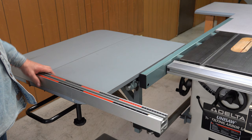And for number 49, start with your saw blade all the way up and then put it at a 45 degree angle. Pop open your service door. Grab a can of dry lube, some kind of aerosol Teflon lubricant, works really well. And do your trunnions up on top. You can see the lubricant dripping down. And hit your different shafts and your worm gears. And give everything a good coating. Turn your different parts a little bit, give it another shot, and your saw will thank you. Mine was starting to get kind of cranky and loud. We had to give her another blast.